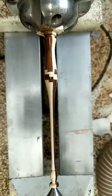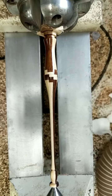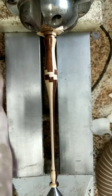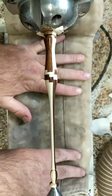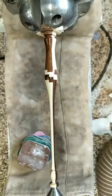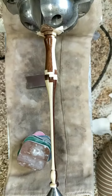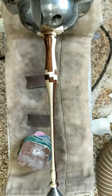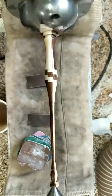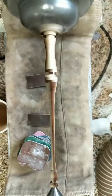And then once that's all done, I applied my two extra coats. Now I'm going to wet sand. So let me grab a couple things. Something to protect the lathe bed, which is my old nasty towel, micro mesh, and then some sandpaper and really fine grit. And then here, I run about 1300 RPM for wet sanding, something like that.